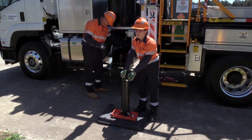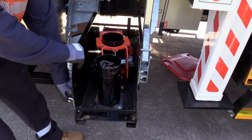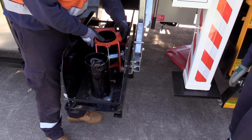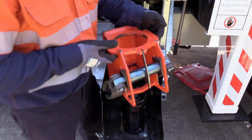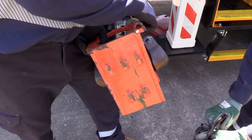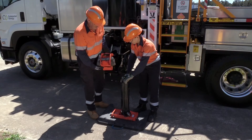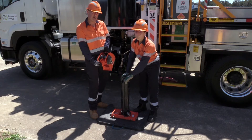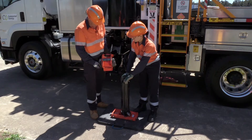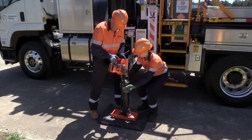We now need to get the lifting ring out of the cradle. To do that, we slide the tray back out so again we're not bending and lifting. The spikes go towards the pole. This is where we need to be careful — we may create pinch points, so we need to keep communication with the person that's helping you, and we need to now slide that over the pole jack.